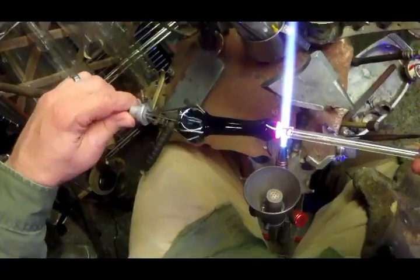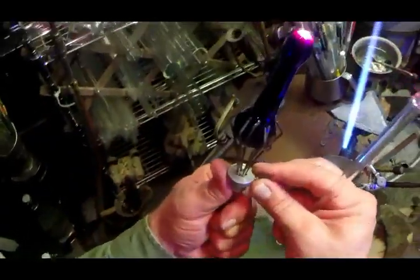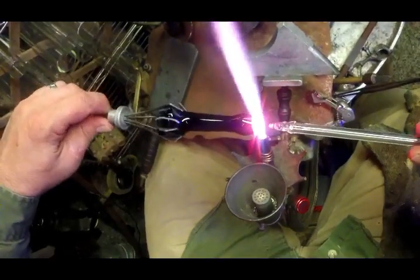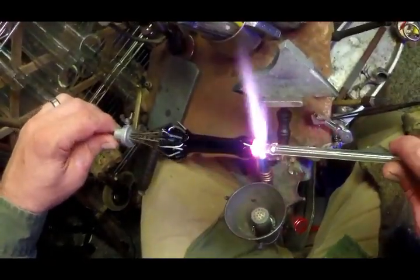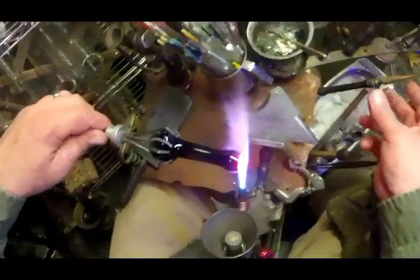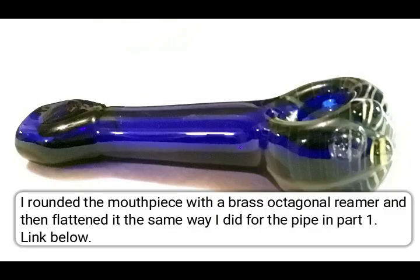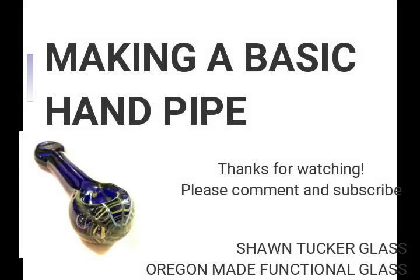Very little waste in this method. I got a little out of line there, so again heating up just the material we want to remove — push that in, pull it out, and then heat it off in the flame. Pretty soon you don't have enough material to support and you wind up with a nice clean little hole in the rear. Same as the first one, flatten the mouthpiece and drop it down. Thank you very much for watching — I hope you enjoyed it and I hope you give it a try yourself.